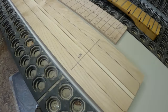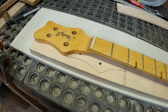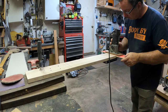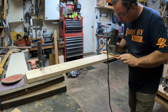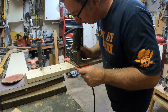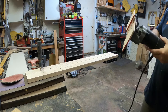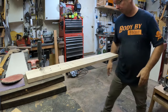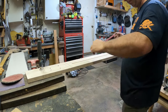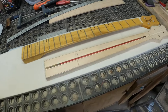Okay, layout is done — the neck blank cleaned up really nicely. That was a nice glue-up. If you put the heel down there, that's a heck of a lot shorter — super cool conversion. Next is to get a truss rod slot in this thing before I taper the sides and cut it out. Okay, that took multiple passes. There's the difference between them — that's the conversion neck going on.